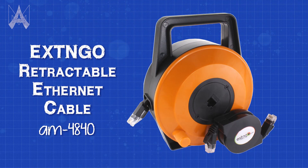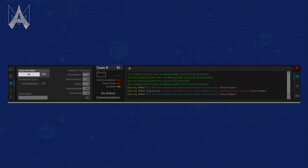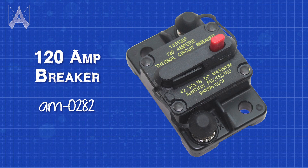The last section is the power on check, where we'll power on your robot and make sure you're ready to play. This is an opportunity for you to show the inspector that you know your robot — you should know where the valves are, where the gauges are, how to power on your robot, and where to find a battery and how to plug it in. The power on check may be done with a tether if you've already programmed your radio or if you don't have your radio in your robot. The robot signal light (RSL) is used to communicate what mode the robot is in and must be visible from three feet in front of the robot. The RSL must be plugged in directly to your RoboRIO and must flash when enabled and be solid when disabled. The inspector will ask to see the driver station, confirm your team number is set correctly, and confirm you have the correct version of the driver station. Lastly, the robot inspector will verify that your robot does indeed power off when you click the power off button on your breaker.